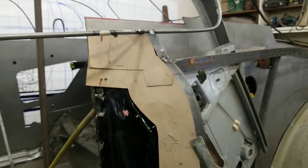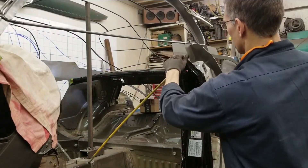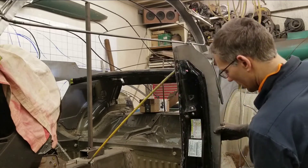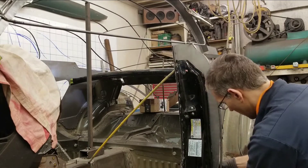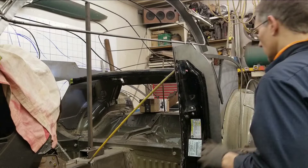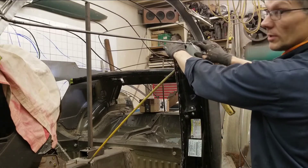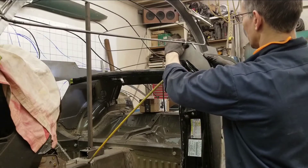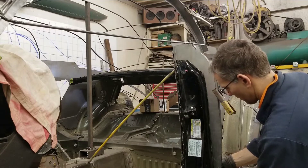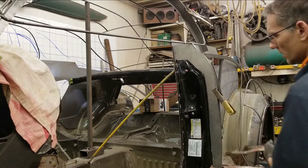Let's go make this piece — actually, make two of them. Let's get this piece installed. Just wiggle it in. Now let's get a few squeeze clamps and vice grips on this — I just want to clamp it to the wire frame. There's a little hole here, but the flange of the skin will roll over that, so if we do have a small hole at the moment, it will get covered up later. We want this to fit as accurately as possible. Once you get everything clamped and sitting correctly, we'll throw a few screws into all this.